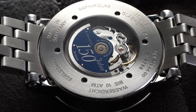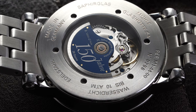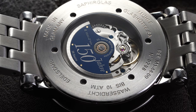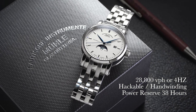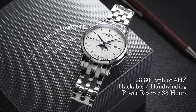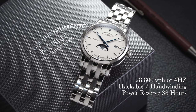The Woodpecker Neck is a patented regulator system invented by Mühle back in 2003. It plays off the swan-neck style design seen in other manufacturers but improves on it with very fine, sensitive adjustment for timing while also upping shock resistance. The movement operates at 28,800 vibrations per hour (4 Hz), features hacking and hand-winding, has a 38-hour power reserve, and typically delivers great accuracy in the low single digits.